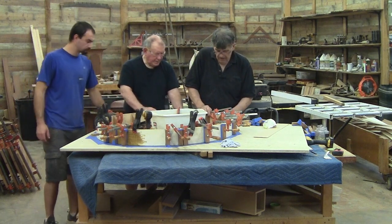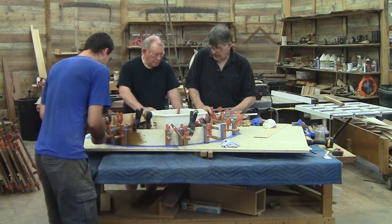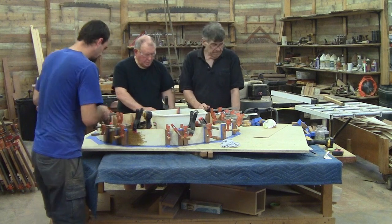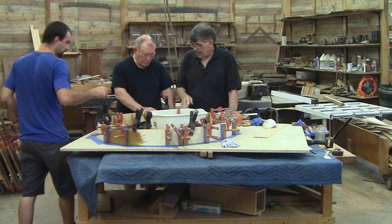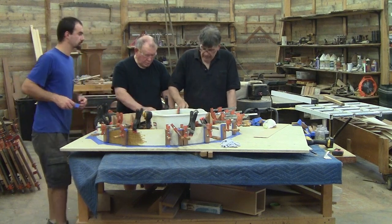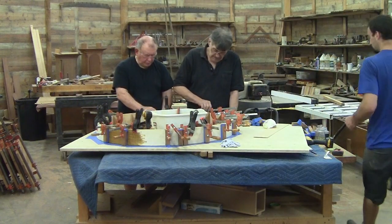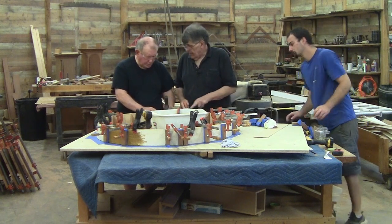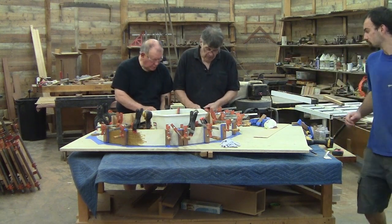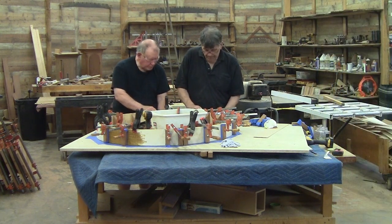Now, in the event you get in trouble at your joint, which I did on the plywood, a sanding block and a little teeny hand plane, I was able to tweak it out. Well, you've got a little gap, but see right here? Oh, yeah. You haven't pulled in. Okay. You got to walk it around. Start at one end and come to the other. Okay. I got it.